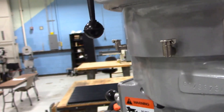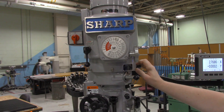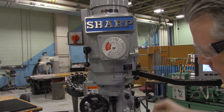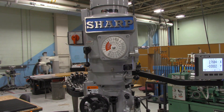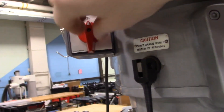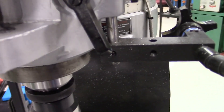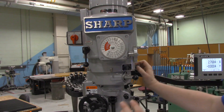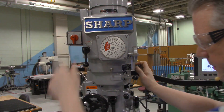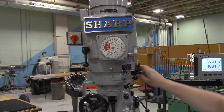The reason I'm showing you this is that when we switch back and run this thing in low speed — I've switched gears to low speed — when I run this forward, you can see the spindle is actually moving in the opposite direction. I can demonstrate that. I'm going to go up here with the camera to show you that when it's running in the forward speed in low mode, the spindle down there is spinning the opposite direction. So here's the whole point: when it's set up for low speed, reverse becomes forward and forward becomes reverse. So low speed reverse makes it turn to the right for a right-hand cutter. High speed, then everything's straightforward.